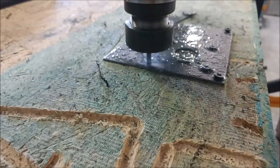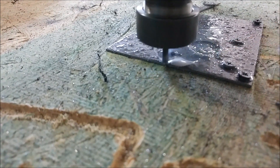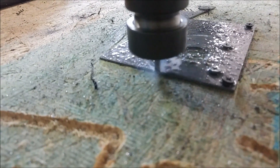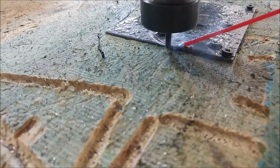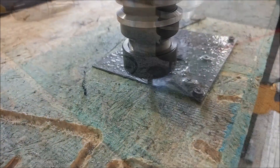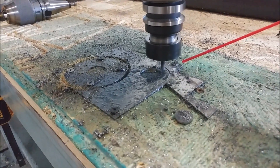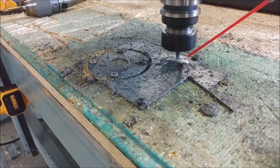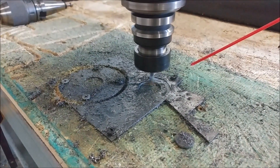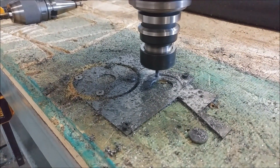The next thing I had to do was mill some little round flat plates for the aileron control, which I'll show shortly. That's basically some circular bits with bolt holes in them — they bolt up to the aluminum ones I did last week. Along with the larger circular plate there was a smaller one as well that didn't have any bolt holes, basically just a hole in the middle with a ring around the outside — kind of like a big washer. You'll see in a minute how all these pieces come together. Getting good at milling the 4130.